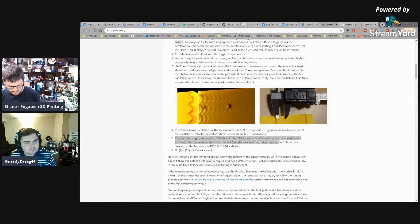Okay, and was that on the X or the Y axis? That was on the front. Okay, so that's your Y ringing. That makes kind of sense. It's a little low, but it'll still work. Now, question: does this change if you change the tension on the belts? Yes.